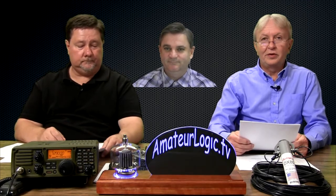That's a great tip, George, because I've been playing around with JT65 on the Pi over here, and I ran into a problem where I was running a hub, and I found that the little USB sound card I was using was a bit unstable. The volume was going up and down, and what you've just told me is possibly the cause. It could have something to do with it.